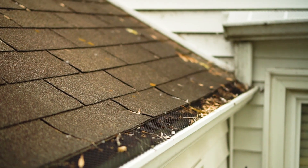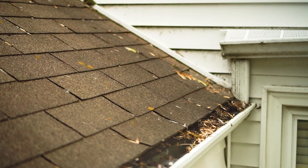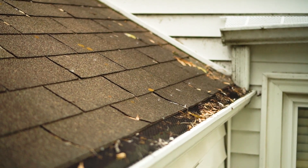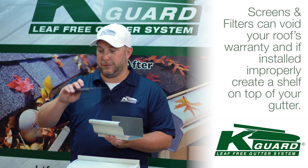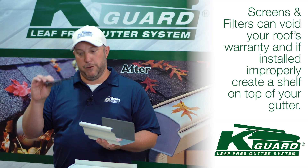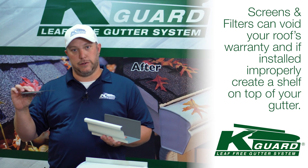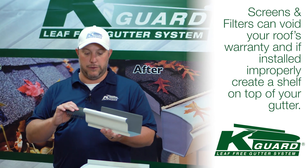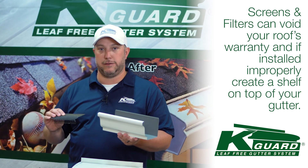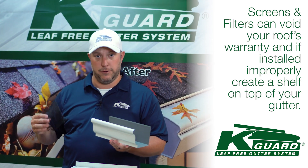The problem is small debris still gets through there — your roof granules, your seeds from maple trees, what people call helicopters or whirlybirds. I'm sure everybody's seen the guy in the neighborhood that has screens with what looks like soldiers sticking out of their screen. Eventually the seed drops in, gets in the gutter system, and if there's any dirt or debris in there it acts like a soil platform, and next thing you know you have trees growing out of your gutters literally.